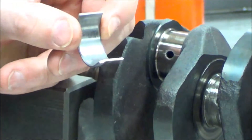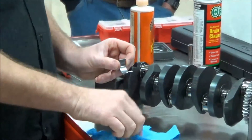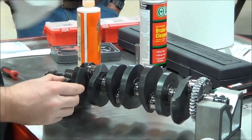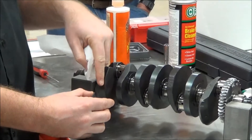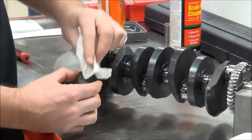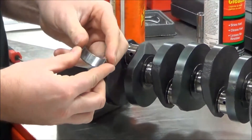In the case of you guys out there doing this in the real world, you'd want to use some rubber gloves, contact cleaner, and be really careful with it. As we clean it, we don't want to be wiping across here, which would actually push the debris in. We want to spray that down, let the aerosol push any dirt off, pat it down dry, and then use some compressed air to do the final cleaning on that.